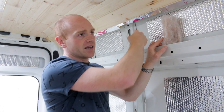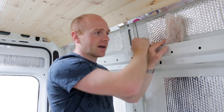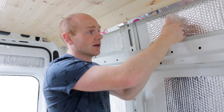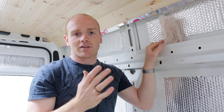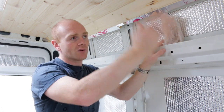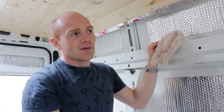The argument is that it'll dry out and come back out, but it's already condensed and will start dripping down. In some vans that'll cause rust; in others you could end up with mold building up. It's simply not like a cavity in a wall where lime and stonework can breathe out the other side — moisture can't go beyond the metal. So a breathable makeup doesn't really make much sense.